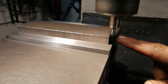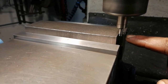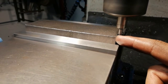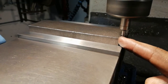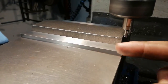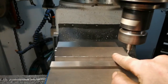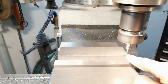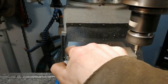Now notice that this thing here is 0.2 inches in diameter, so the actual start of the edge is 100 thousandths away. This is very important. I have to either add 100 to everything, or actually move the thing 100 and then zero it out. Now, since we made this pretty precise, this is five and a half inches exactly, so it's going to be pretty easy to figure out where the other hole is also — I don't have to find this edge here.